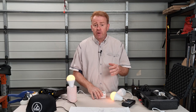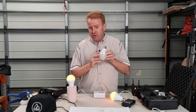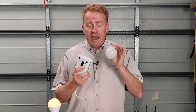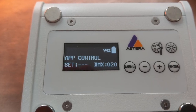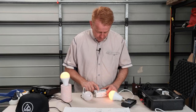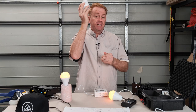Here's another scenario where the controller comes in handy. We want to put the globe into the ceiling and run it off DMX. These globes don't have an internal battery but they run off external DC power. The controller has a battery that will run itself and simultaneously run a globe. So I can plug the globe in and do my setup without plugging into AC. When I power up the globe, the display shows all my settings. In this case I need to change the globe to DMX mode and set my DMX address. I can check the DMX is working, then disconnect — all settings are saved and it's ready to go into the ceiling.